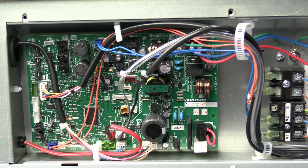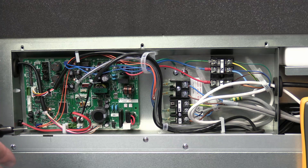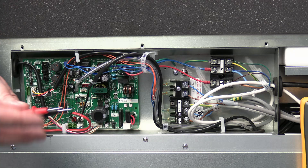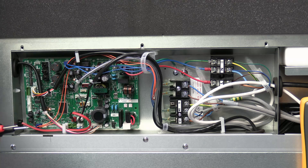Next we're going to check the voltages — making sure we've got 240 volts AC. This checks that the fuse spur is definitely switched on, there's no blown fuse, and that the mains supply is correct.